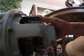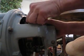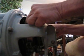We start it up — it's set at regular counter-clockwise operation. Now I will set the brushes; I'm going to rotate them. I've got them loose, moving over to neutral, and it actually speeds it up.